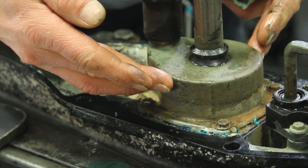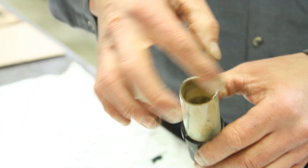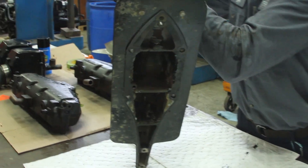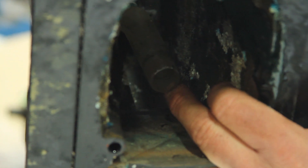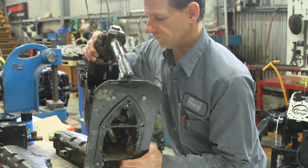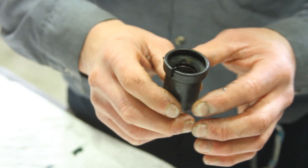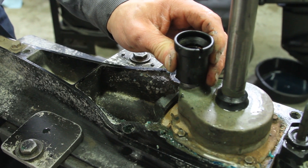This is your impeller housing. We want to inspect all these components. This is called a guide tube — it's basically kind of like a funnel. As long as that tube comes somewhere close to this vicinity, it's guided down and directed right into these sealing o-rings. This tube is small in diameter, about the size of my finger. When you put this drive together, that tube needs to fully seat inside that pump housing. If that little tube does not seat in fully, the impeller is going to pump water and it's going to go past — not into the tube where it's supposed to — it's going to go around the outside of that tube and leak into this cavity. This is a critical little piece.